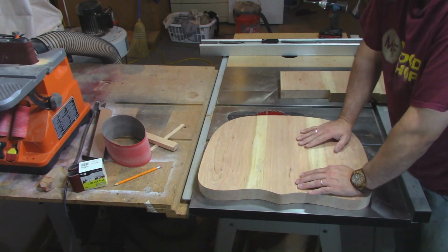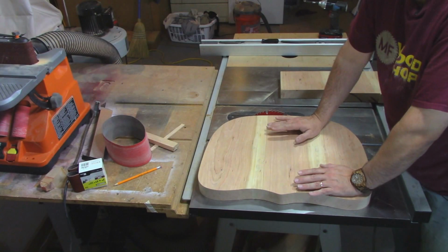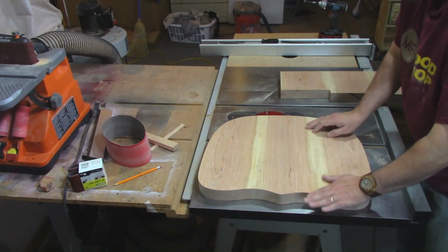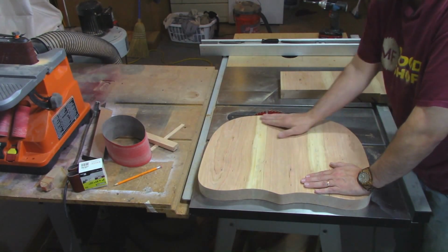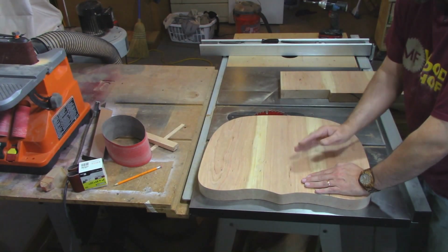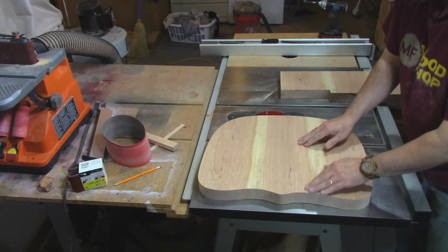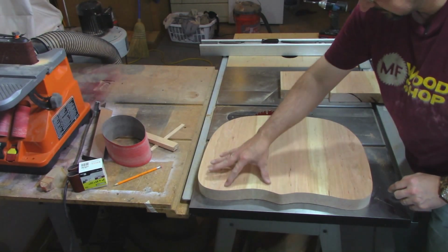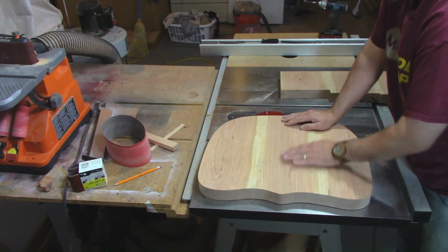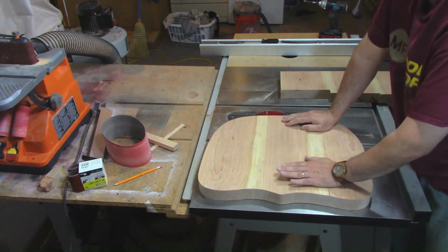And I was looking at the old chair. There's not a whole lot of cupping to it. And I'm even considering doing that with a belt sander. Maybe take it outside one day and just go to town on it, but I think this tool that I'm gonna order will make it a little easier. It's just a die grinder tool, and it'll just help cup that out a little bit more. In the original chair, it's more cupped out about right here, and it goes up like this. So there's not a whole lot of butt cupping, if they want to call it that, to do on this piece, and this piece will be ready to go. Of course, round over the edges, and then the seat will be ready to go.